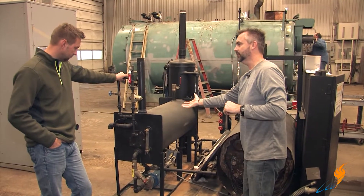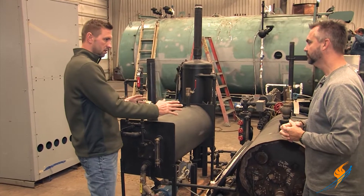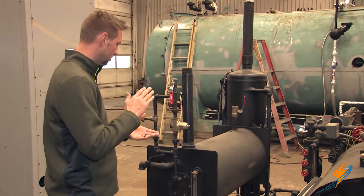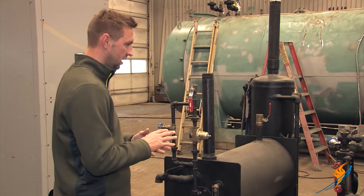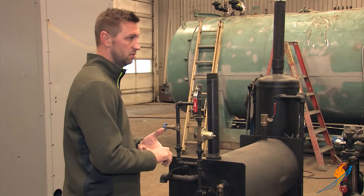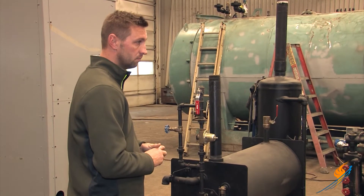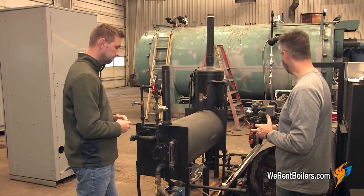You actually need a feed system for an electric boiler. You're still going to have to feed water to the boiler, just as you are over there, and still have a blow down separator. The unit operates exactly the same as a fire tube boiler — your high limit, your low water cutoffs, all that works exactly the same. Where this is a really nice system is if you have space constraints, or you don't have gas, propane, or number two fuel available. If you can't run a flue gas, then this works out well. There's obviously no flue on this unit, so you can be inside, no problem.